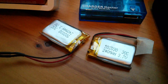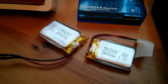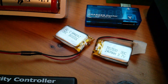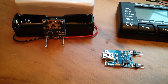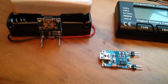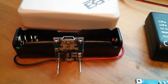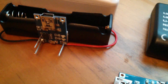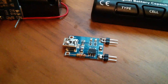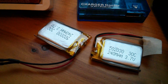There are the two helicopter battery packs — lithium polymer 240mAh — which I'm going to use in various projects. I've already done a video on the TP4056 lithium charger board. One of them is now mounted on the battery holder so I can charge cells and monitor what's going on on those pins I've soldered on. The other one I've modified with a 10k resistor so that it can charge at a low current for these small lithium polymer packs.